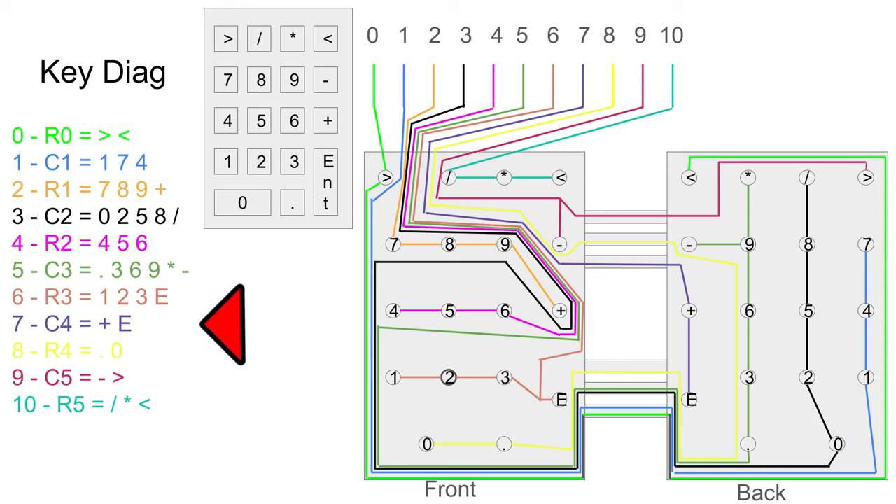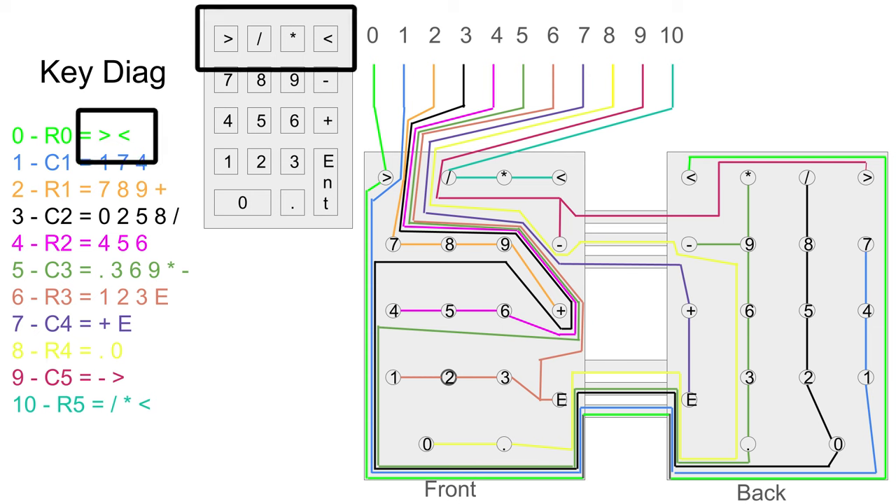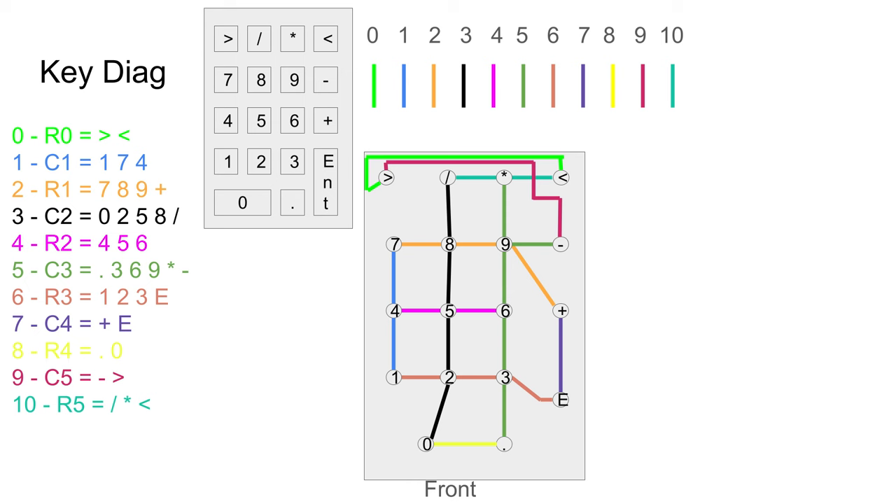It alternates but seems to arbitrarily set up the first pin, and then the last two are just rows, but it's laid out in a way that's sort of crazy. I did a quick diagram to try to make sense of it and figure out how each key would be recognized — and to me this looks insane. On the left I've written out every pin, whether it should be treated as a row or column, and the symbols affected by it. On the other half of the page is all of the pins and where they route across the two pages. They only have a couple rows and columns that are even remotely close to the way I'd expect. The only complete column is 0, 2, 5, 8, slash, and the only complete row is 0 and period. In every other row or column they've included or excluded a button, and it seems somewhat random as to how they determined this layout.